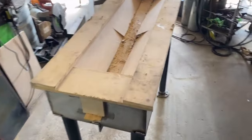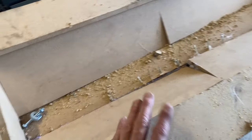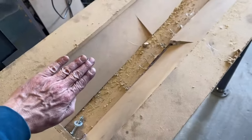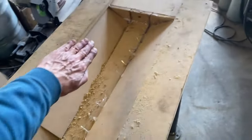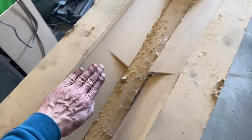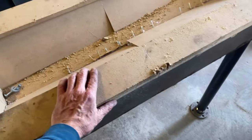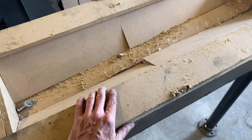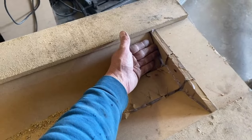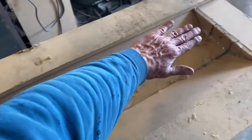Alright. Here's that hip I was talking about — that's why I had to bondo this, because we have two different pitches on this gable. For a sheet to go from one pitch to the other, it requires it to warp to the new pitch. It starts off at one pitch and slightly warps to match the other. You can't make a rigid sheet do that.